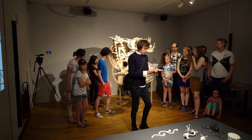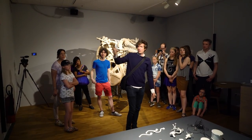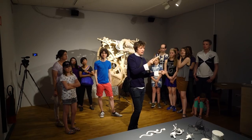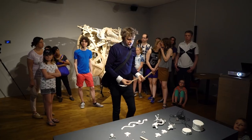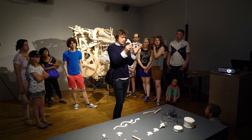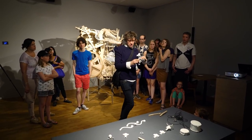And why I think Marble Machine X is gonna be such a success is that if we note a problem with this one, I can go into this drawing, change this a quarter of a millimeter, make new pieces, and correct the mistake. And we're also using some 3D printing for the instruments. We're gonna finish all these pieces with acetone, you can put acetone to make them a nice surface, and paint them, so they're not gonna look like this, they're gonna look nice.